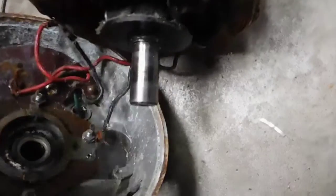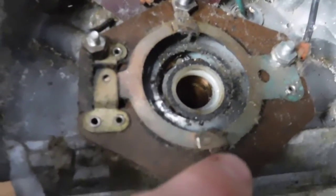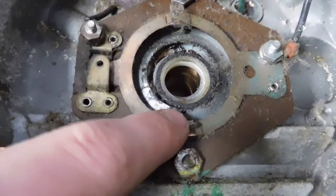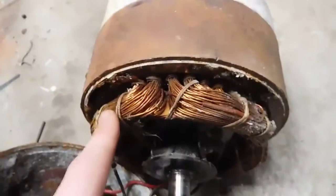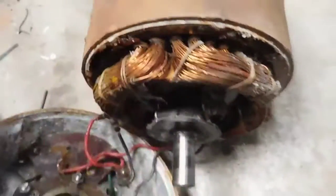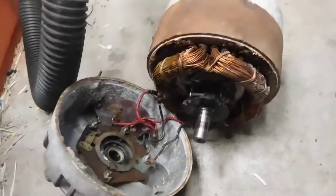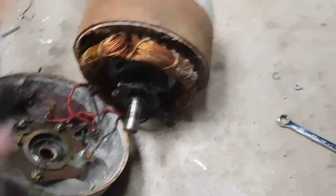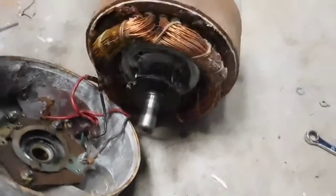There are your little contacts there. Basically, when it spins up, it pushes that in. It's pushed in when it's stopped, then it winds up and releases that — cutting power off the start winding and onto the run winding. This being a four-pole motor, because it's only 1440 RPM. I'll get all that wiring separated, and then probably belt that shaft and see if I can push the rotor out, presuming it's not seized in.